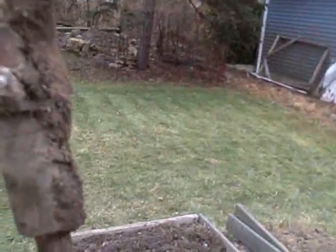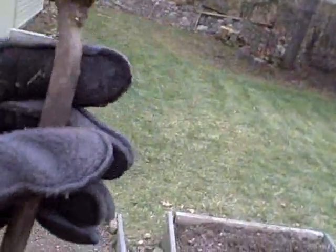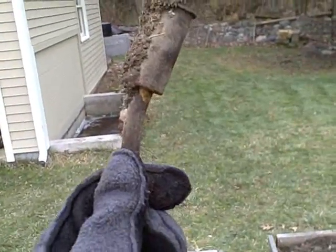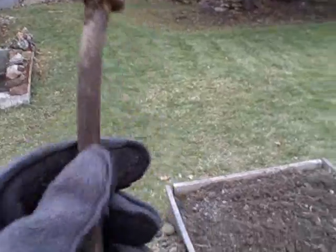The screws are kind of hidden in there. What I did to modify it: I took a piece of tool steel and cut the same taper on it that is on the end of the pole, then I took a piece of drill rod - which is oil-hardening tool steel - and I brazed it in. I had to stick the whole thing in the gas burner because my propane torch wasn't hot enough to get the whole mass of the metal hot. I probably did this 20 years ago.